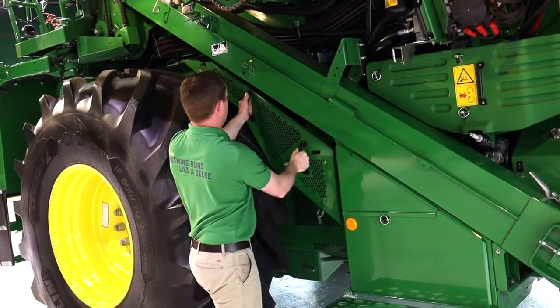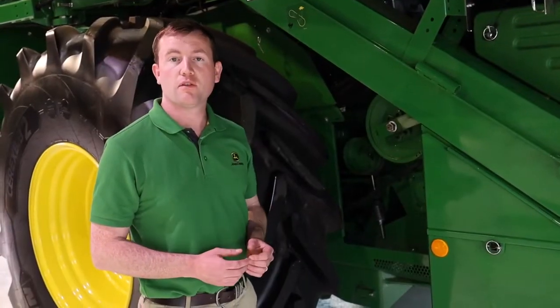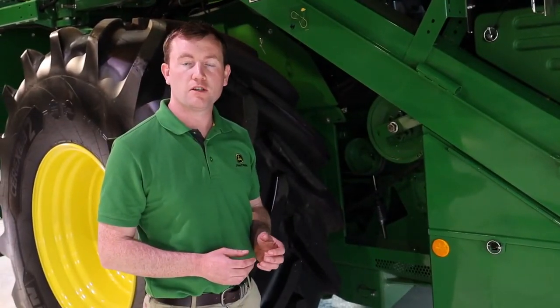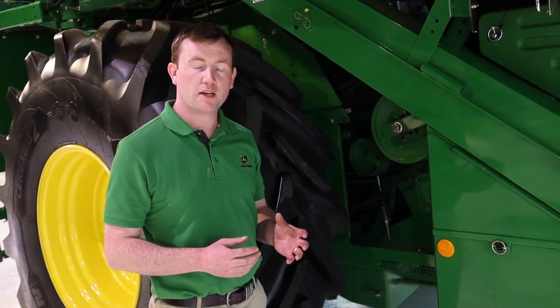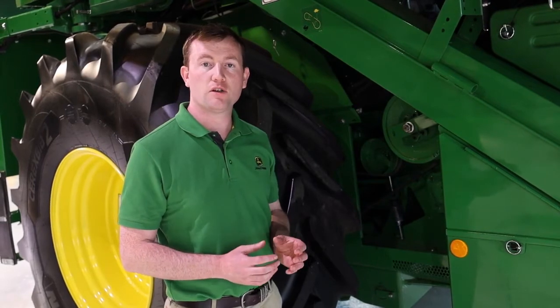Another key feature of this cleaning shoe is the barrel-type fan. Not only does this dramatically increase the airflow within the cleaning shoe, it also provides stability, allowing the customer to easily set up the cleaning shoe and ensure maximum performance throughout the day. This has resulted in new cleaning shoe areas — in a 6 walker it is 6.3 square metres, and in a 5 walker it is 5.2 square metres. Both are industry leading figures.